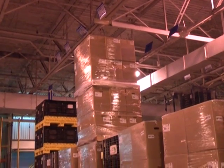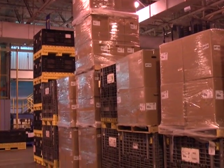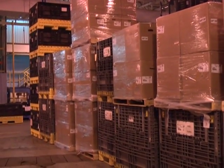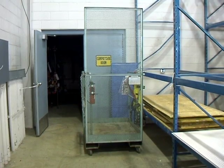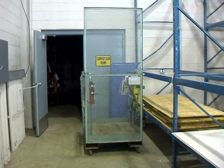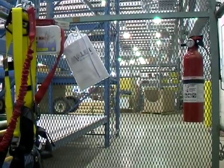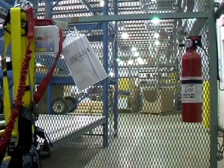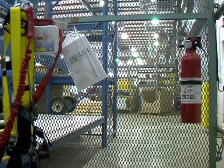Make sure pallet loads are shrink wrapped or strapped properly. Ensure your load is secure and that the pallet is not broken. Do not use the forklift to lift people on forks or a pallet. They must be properly secured in a lifting device. If the man basket or platform has not been approved, do not use it. Ensure safety kit, fire extinguisher, and safety lanyard are properly used.